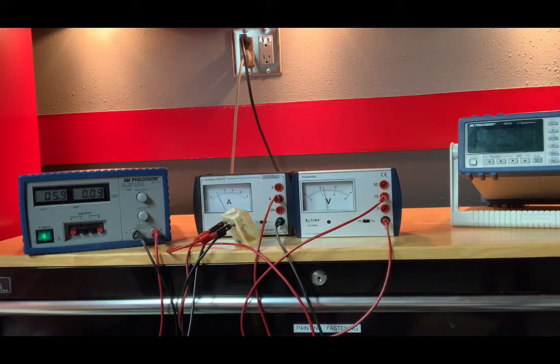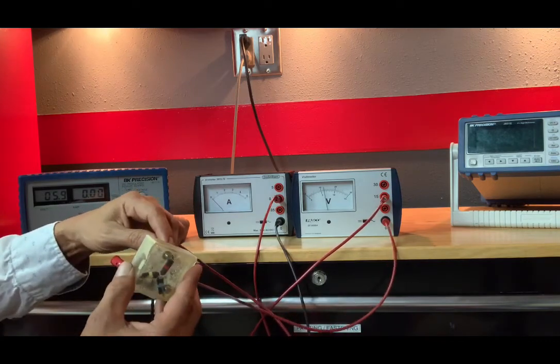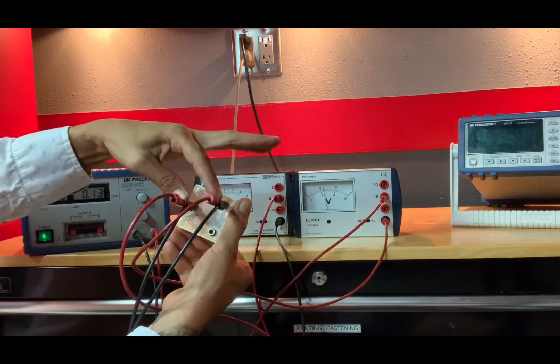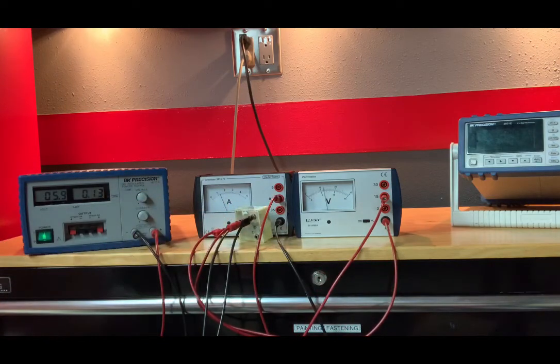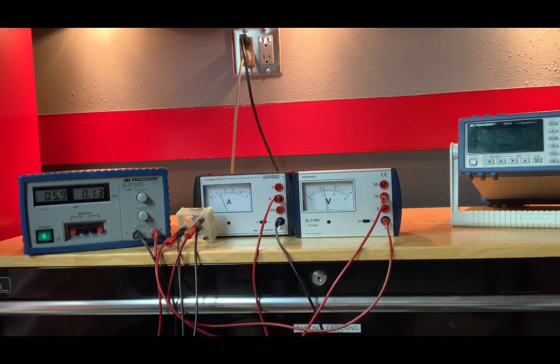So the next row, for your RBC, those are calculations. Now let's go down to VCA, or in our case, V yellow red. We're already in the yellow. I'm going to move this connection to the red. Yellow, red. We are indeed on those top two ports. Volts, 6.0 volts, doesn't change, on the 15 scale. For current, I'm getting 1.30, but of course, because of our 0.5 scale, I need to divide by 10. So for the current, we have 0.130 amps. Scale is 0.5. And we're done with this section.